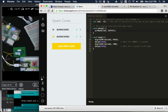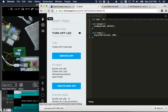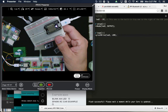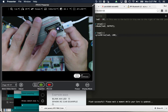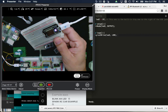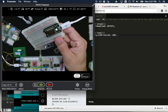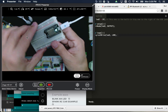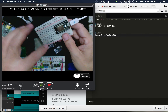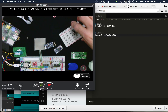I can turn off that LED. I have a 'turn off' command as an example, and I can basically say flash that again. You can see it goes rapidly through this blinking magenta that says the flash is coming over the air. Then it'll turn off the LED and make it low in this case. It does take a few moments to go through that flashing process — it flashed green there briefly when it's reconnecting to the Wi-Fi. But now it's programmed and you don't see the LED blinking anymore. I really love that over-the-air update with the Spark.